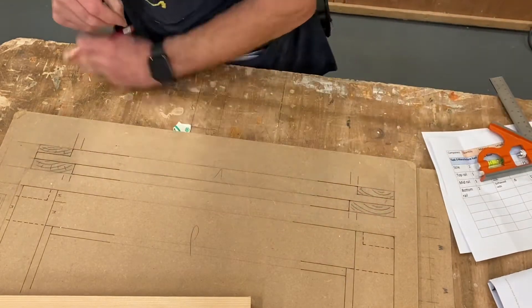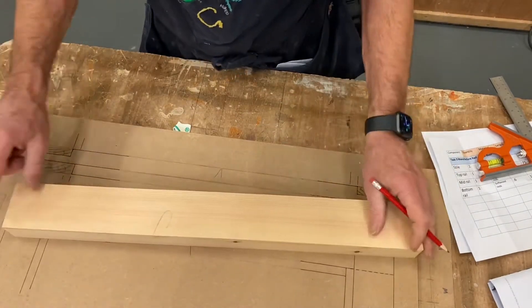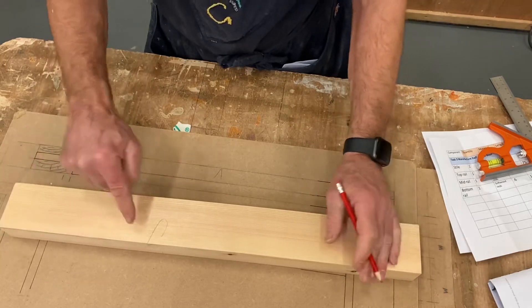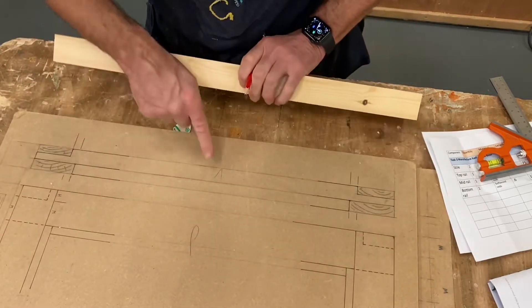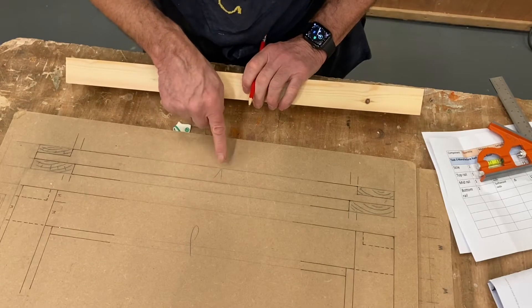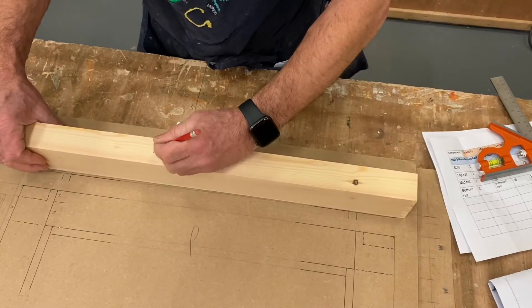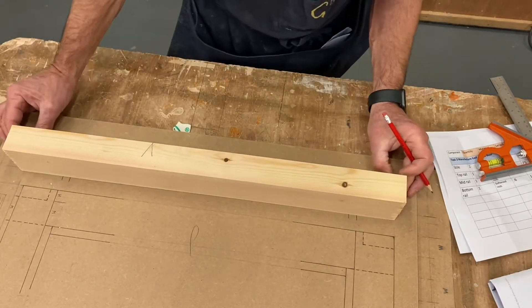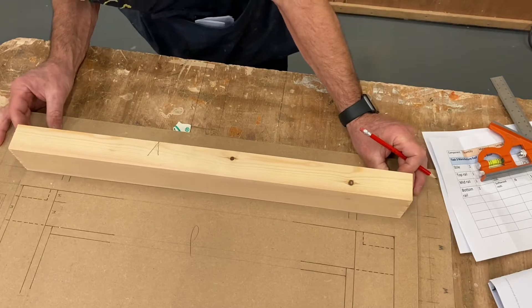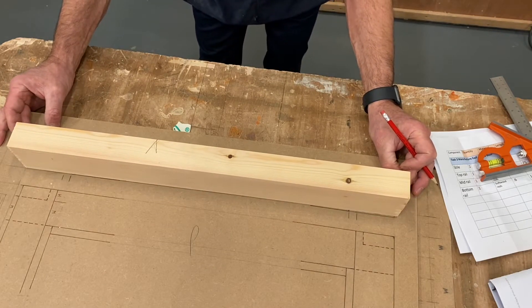The position of the shoulders for the top rail: the longest shoulder is on the face side because the face side has the rebate. You can see from there that that is the rebate, therefore that must be the face side. Put it that way to match that direction, place it central — this is just a bit longer than the 600 so we've got about 5mm either side, so just put it nice and central.